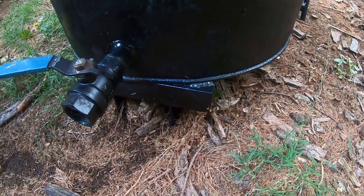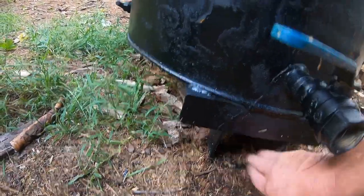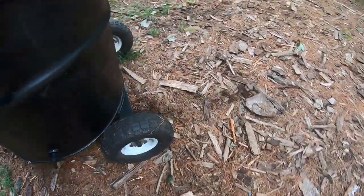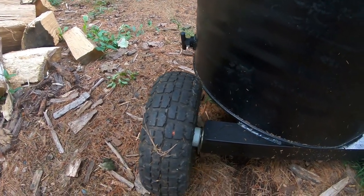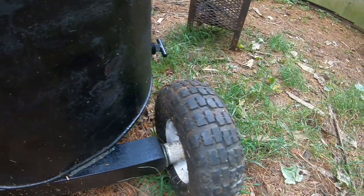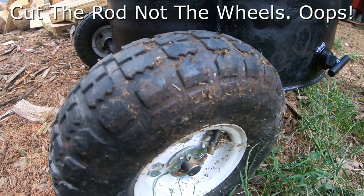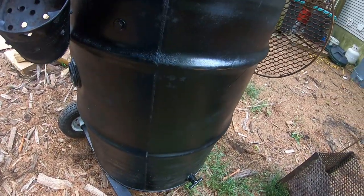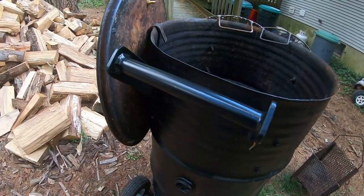On the bottom I welded a piece of angle iron across the front lip and bent some metal underneath for a standoff in the front. On the back I put two wheels from Harbor Freight — $3.99 each. I welded short pieces of 5/8-inch rod on each end of angle iron welded to the drum's bottom, slipped the wheels on, marked and cut them to the right length, drilled out the rods, put a washer on each side, and added a cotter pin. I also welded a handle on the back so I can move it around easily.